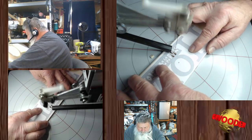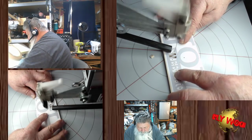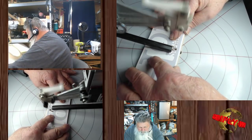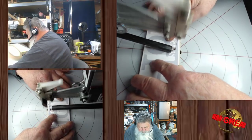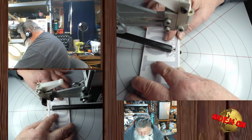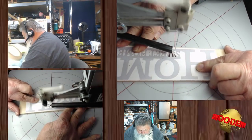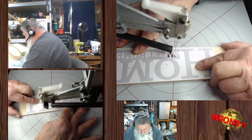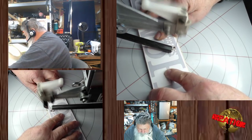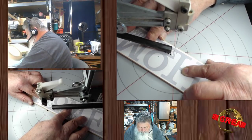I got my laser going on something quick behind it. Is that with the little potentiometers on the drivers? No, they're physical screws you adjust the mirrors with. Oh, okay. If it's all the way to the left and you're trying to laser something, it's fine. But if you get out in the middle, the beam goes up too high and the left mirror misses it.